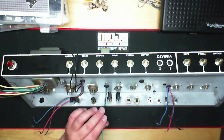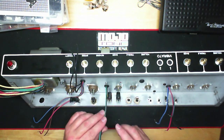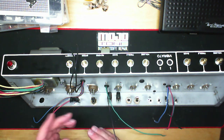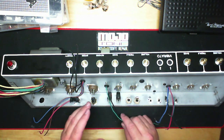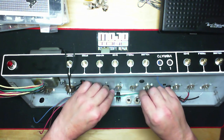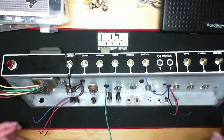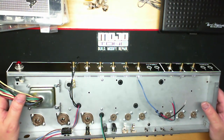Again, output transformer, the secondary wires are further away. They have them terminate through the chassis, further away from the primary and from the AC that come down here, that are very short because your jacks are right here and only need to be that long. So it was very efficient in the way that they thought about things and made them.